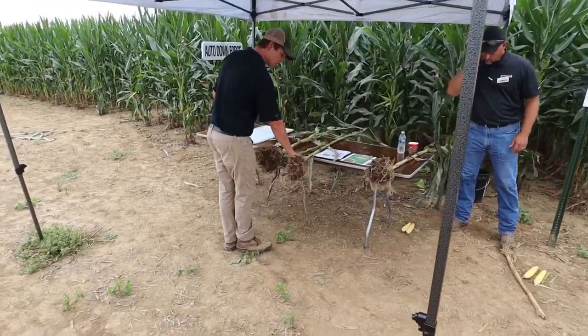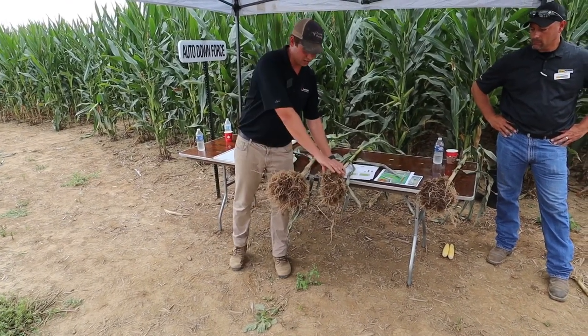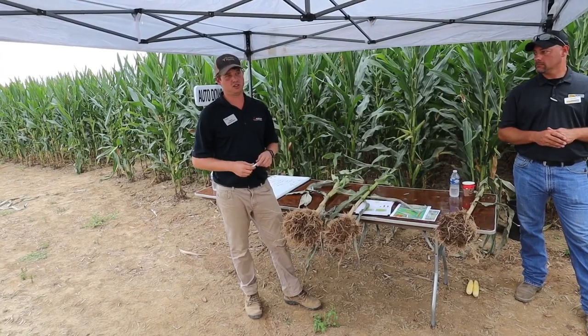Whenever I say downforce, I should explain what I'm talking about. That white planter is equipped with hydraulic downforce — the theory is that your planter units have constant down pressure on them. Whereas my planter uses pneumatic down pressure — it's air, a fixed pounds of air pushing that planter down. Downforce is what's keeping your unit on the ground, giving you consistent planting depth. Hydraulic downforce is going to be more consistent than pneumatic, giving you more consistent plant depth and more even emergence — that's where it's supposed to make you money. It didn't look a lot different, but look at the root development on these two: obviously there are a lot more roots on this one all the way to the side, whereas here it's more straight down. From the visible eye we couldn't tell the difference. If you don't have automatic, it's better to have too much down pressure than too little.